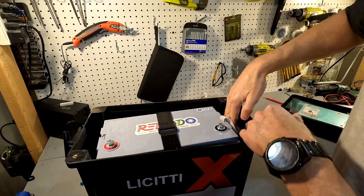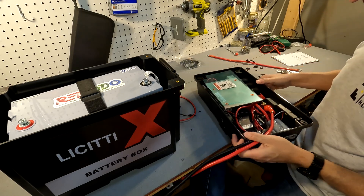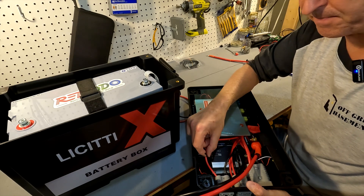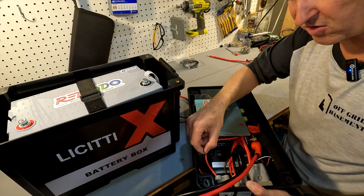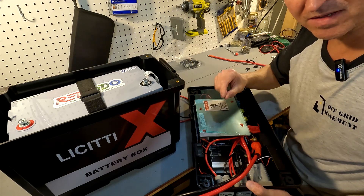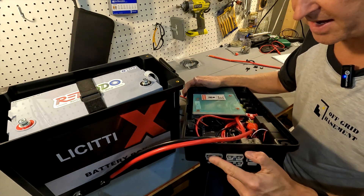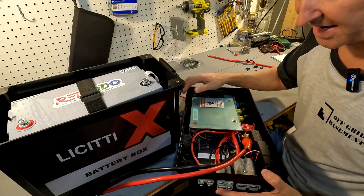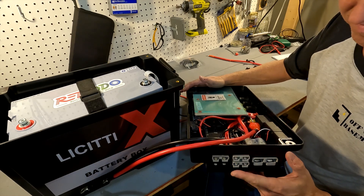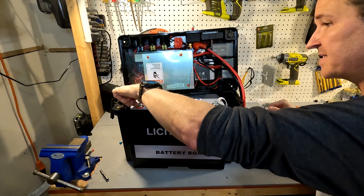While removing the tape from the battery connectors, I noticed that the MPPT has a temperature sensor. I want to see if this sensor acts as a cold-charging sensor that will stop charging if it's too cold. We'll test the hot side too, to see if it stops charging from solar. I don't think this will affect anything if you plug directly into the 50 amp or 175 amp connectors, since those bypass the MPPT — but through solar it might.